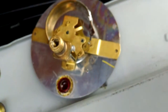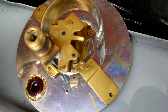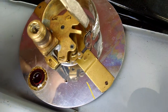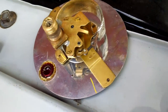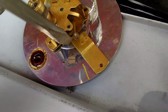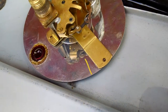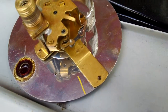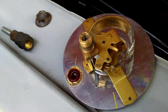This brand new gauge works exactly the same way — interesting that they still use the same design. To fix the zero, you're playing with mechanical advantage. I had to adjust this metal bar — you can either bend it or straighten it — but I also had to desolder it from the tube and move its position. Then to increase the range, there's this elbow piece of curled metal shaped like a C, which acts as a lever. I had to squish that in a little to shorten the lever so it would throw the needle further.